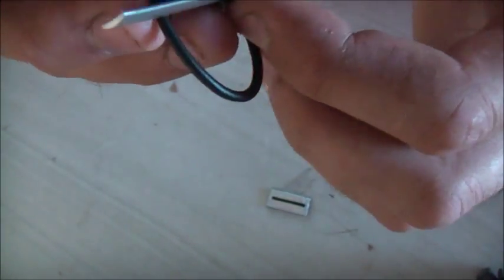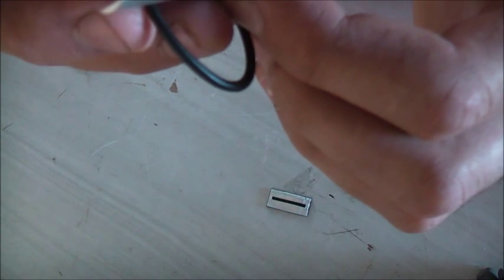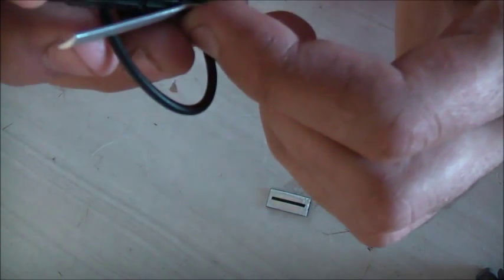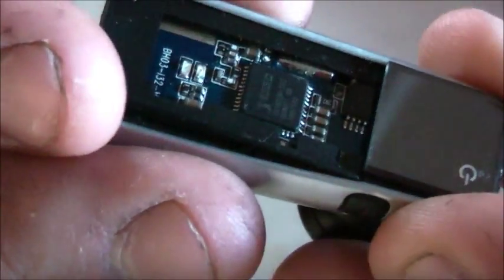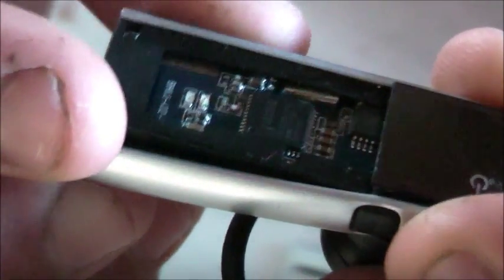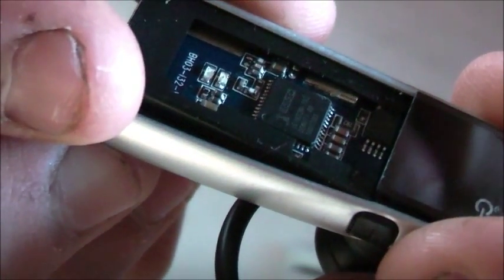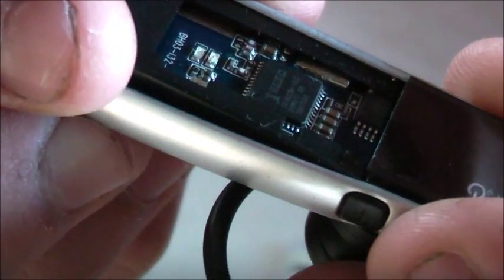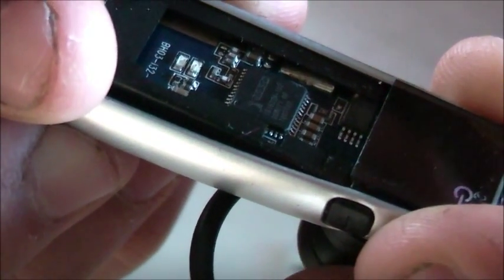There's this tiny little chip here. It's an ISSC — it's the Bluetooth transmitter chip. It's got a picture of an antenna or a tower with microwaves coming out of it. The camera won't zoom into it very well. I'll try and read what's on it: it's got 15163TM-102, DIM071-00, and under that 1001703. Yeah, that's the actual Bluetooth sender there.